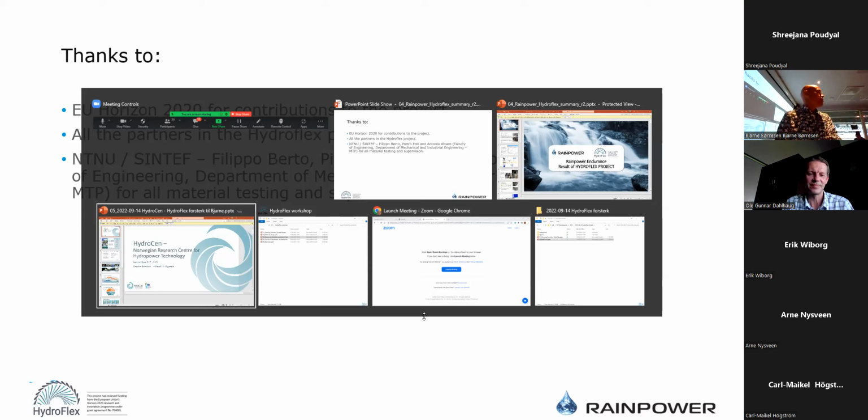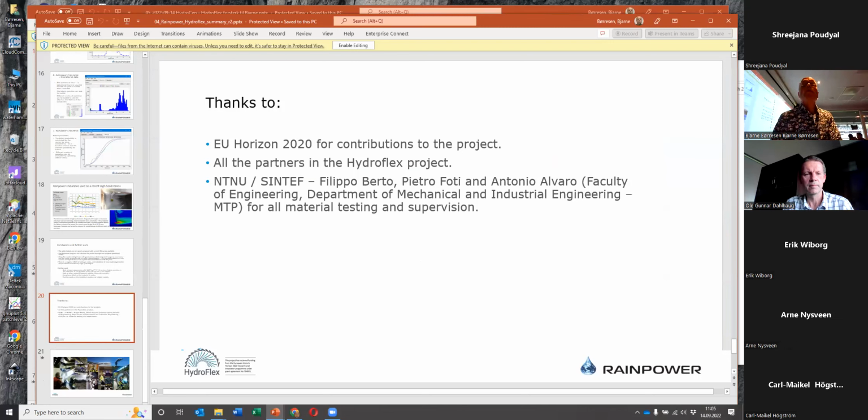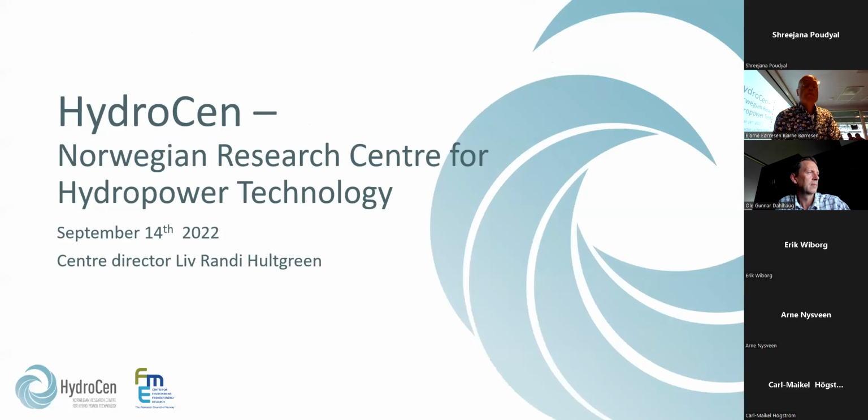Thanks. Björn. I'm just curious, the operational history data that you show, how much pre-processing have you done on that? How much cleaning have you done on that data to be able to say with certainty that you're not just picking up a bunch of transients that you assume are steady state operations? You know, this is different from plant to plant, how accurate their historical data is. Some are quite precise, some are not. We have not used the program really for all runners yet. The program is made for this, but we have used it for new units.